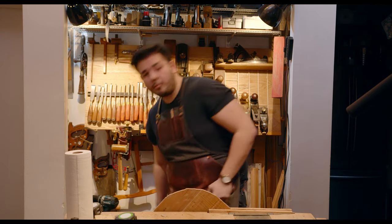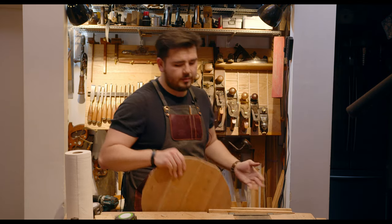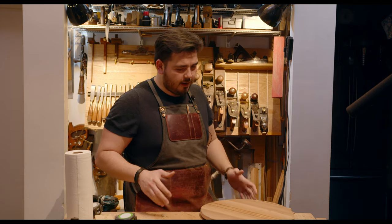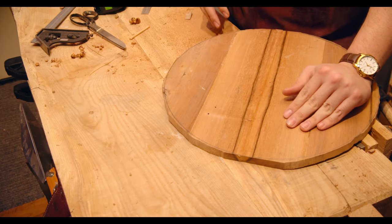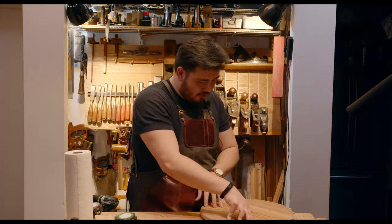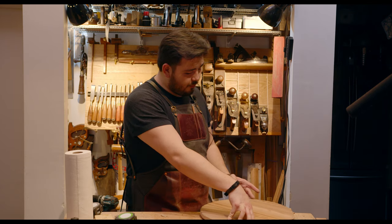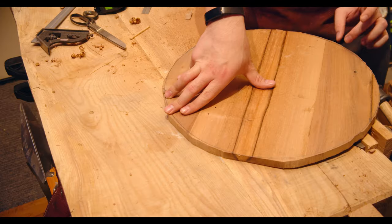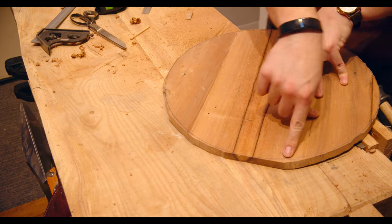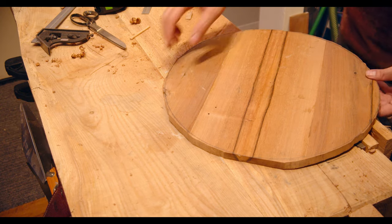It's important we save those scraps so we can look at what finishing is going to look like. As you can see it's a pretty irregular circle — a lot of places where I got close to the line and some places where I wandered away. Making sure not to hit the line since we're going to clean it up now. The really high spots — big flats like here, here, and here — I'm going to hit those with a rasp first, just to get those places down.